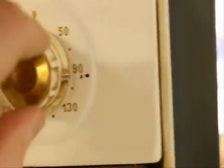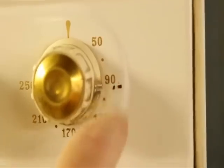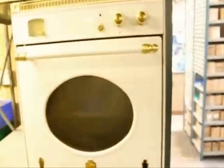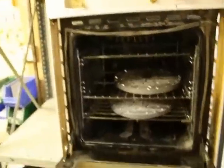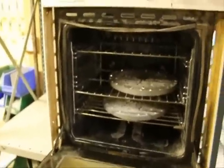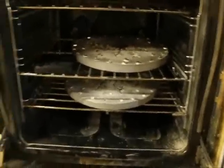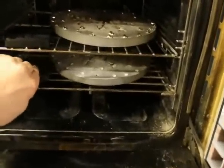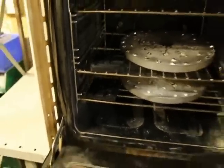Kitchens are bad places to store molds due to condensation. You can use an oven to warm up the mold prior to casting or venting. Set it at a low temperature. Leave the mold in the oven for an hour or two to warm properly. Cold, damp rubber molds will never cast perfectly. Warm molds will allow you to cut vents with a new blade easily.